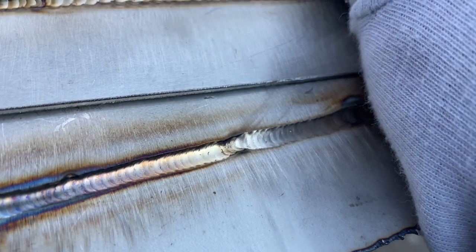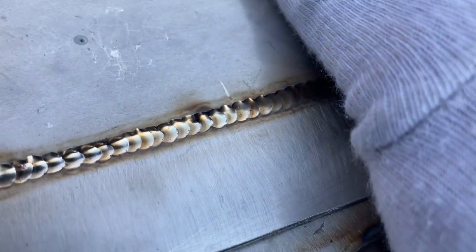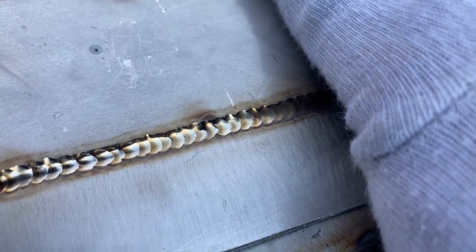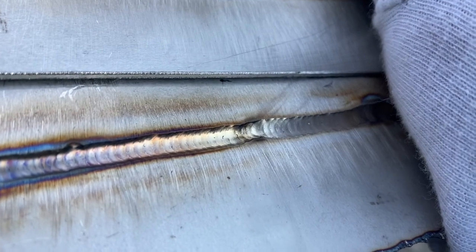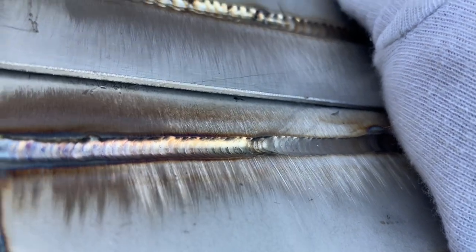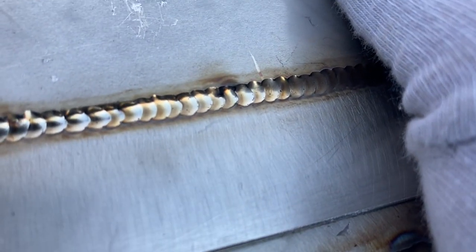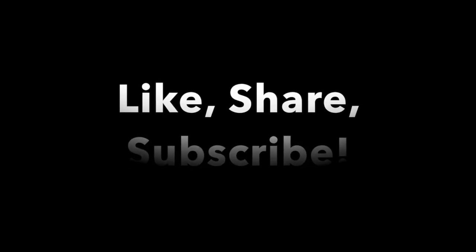I'll show you these welds in the daylight. When the camera's on I can't hold a steady travel speed, but I think I quite like the first one we did with the slower pulse, and the one with the faster pulse — depends on your personal preference. It's a really good way on a little lap joint like this on thin stainless — this is 0.050-inch stainless — to reduce the heat input and still get penetration to the root. Thanks for watching, please subscribe if you like these videos, click the thumbs up and share — it helps a lot. Good night.